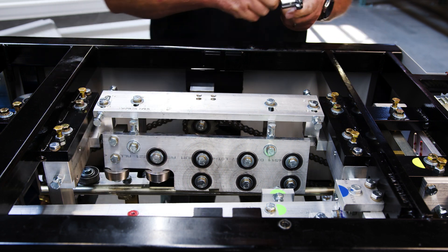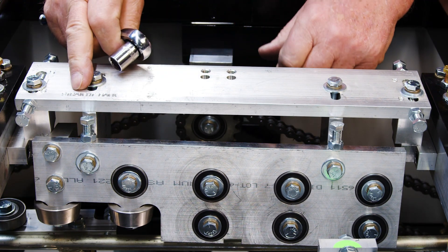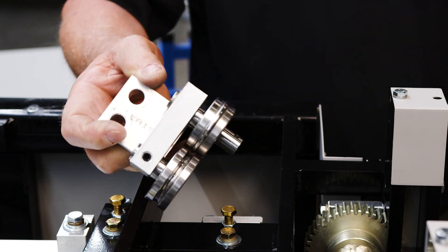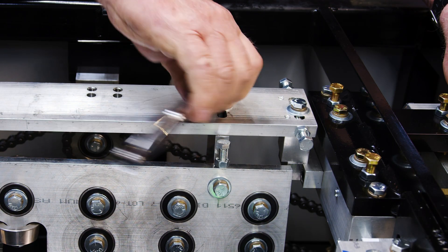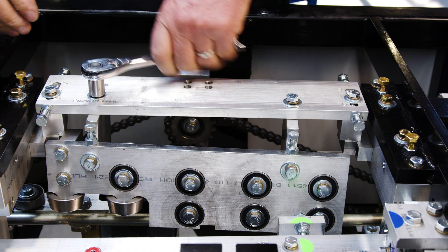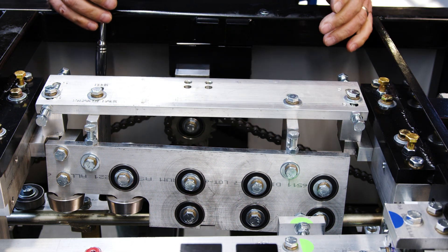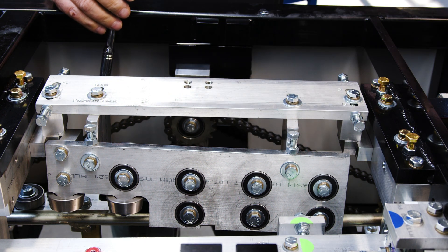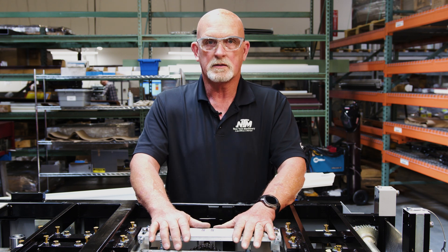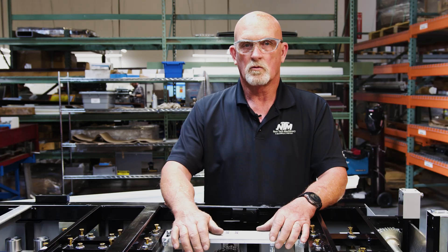One other thing you can do without uninstalling — without taking this out — you can switch it to what we call straight back. Take the bead out here, your crimper, and put the bead assembly in so you can go back to standard setting. To do that, loosen this bolt and this bolt here, push this whole assembly inward and lock it down. Material will come through and pass on the back outside of the hook assembly — basically out of line of the material — and it'll go through without a hook. Now that we've set it up for five inch and six inch, you should be good to go whether you're running five or six. If you have any further questions, go to our link at our learning center. We'll see you guys soon.